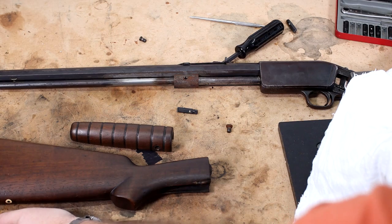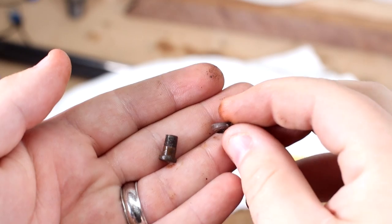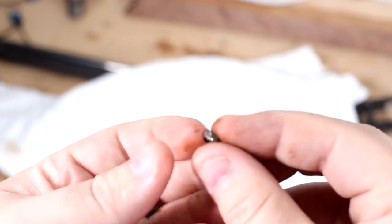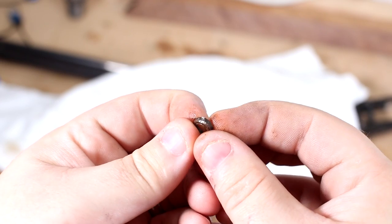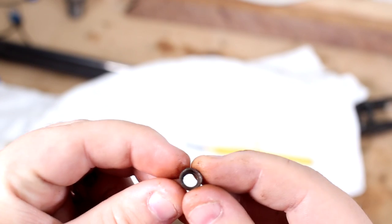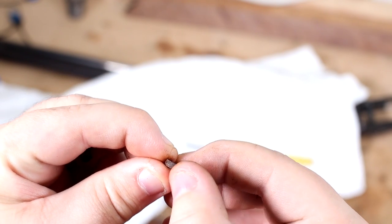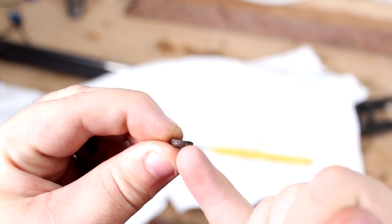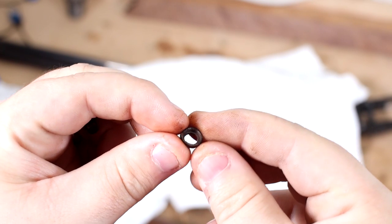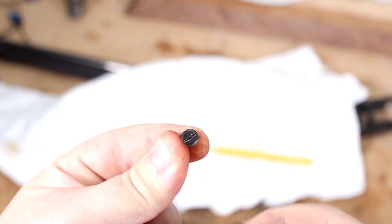I got the cup and the screw apart. I think I could actually salvage this cup — it's going to take a little bit of work. I'm going to have to file a little bit off. I damaged it a little when I put it in the vise, but I think I can file that down. Plus you don't see it from the top side. So I'll file it a little just to smooth it out, maybe put some new lines back in it, and then we'll niter blue these just to give them a little protection from the weather. The screw looks good too — it's just rusty.